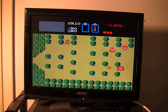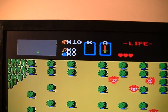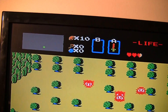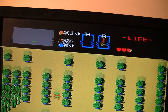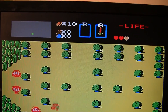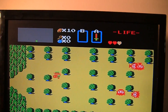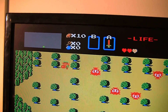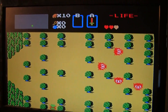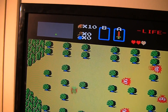But for whatever reason, with the 2553 I get this weird crap going on at the top of the screen, and it's not every scene either. If I go all the way to the very bottom of the map, it doesn't do it — there's still a little bit of jitter up there. But as soon as I go up one, it gets awful. If I switch to the NJM amp, it goes away and it looks perfect. No jitter.